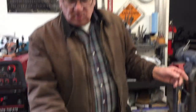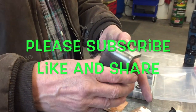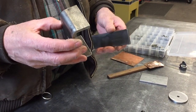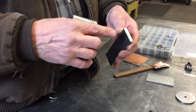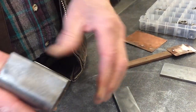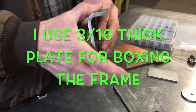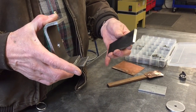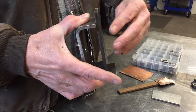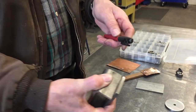For today we're gonna pretend like this is your frame. When you're boxing the frame in, there's a couple of ways you can do it. I'll show you the way I do it. First of all, I'll bevel both edges, but I'll start off by beveling one. Then I'll take a piece of just any scrap steel and clamp it to the bottom of the frame over the whole area where I'm going to box it in. Then I'm gonna take my boxing plate and rest it on that so the bottom is flush where I want it to be.